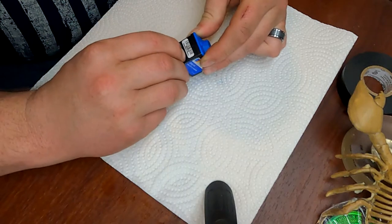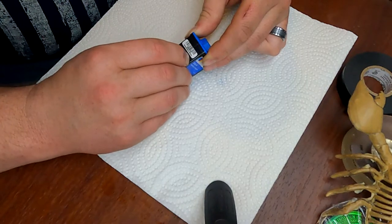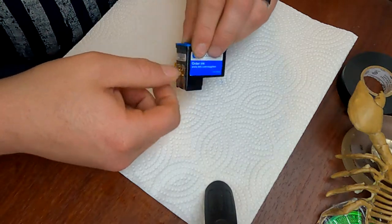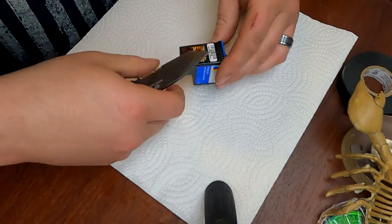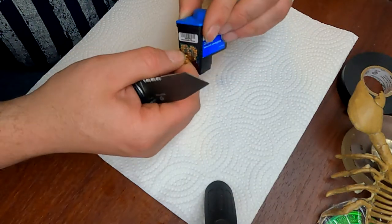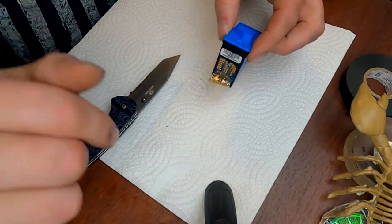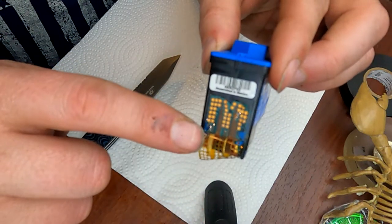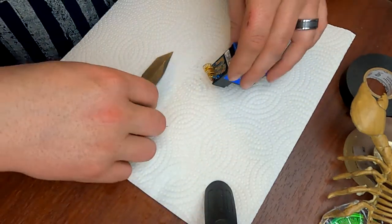That one's not going to be nice about it at all. But anyway, the gist of it is you can grab a hold of these — most of the time they'll peel right off. Sometimes you have to get nasty with them, use a screwdriver or a knife to get all that gold off. And then this screen right here, if you look on the inside there — see the inside of that? That's gold wires in it, that's gold tracing. You want all of it.